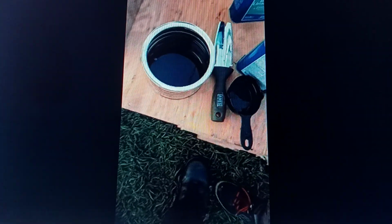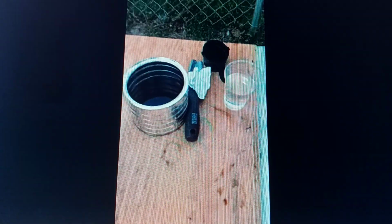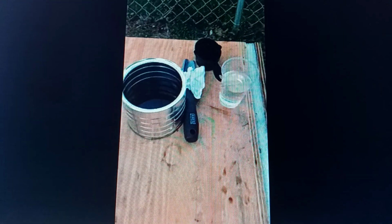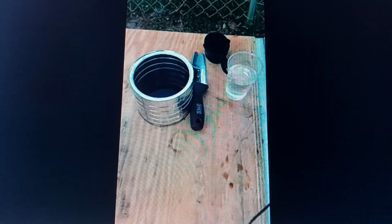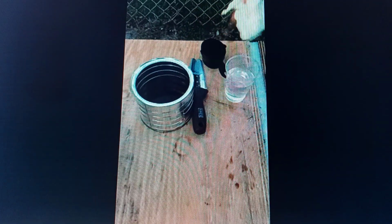And let me see. Give me one moment. All right, guys, I'm back. I had to move some stuff out quick. Let's see here. All right, so basically, I'm just going to show you guys how to use it, okay? When it's still hot in its liquid form, you can just apply it with a paintbrush or a regular old crumpled up paper towel. And if it has solidified like it has on this end of the spoon, you see it's actually not super solid. That's the reason why you added the linseed and the other compounds, to make it more soft.